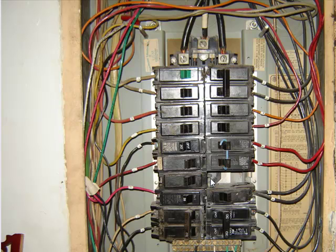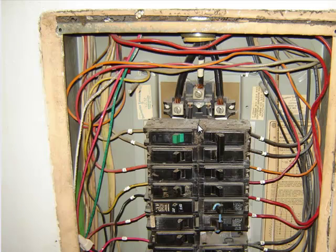It's burned-up lugs. I think I had done a video before of this — the burned-up bus bars in there. This breaker here, same thing — it's just all fried on the inside of it, so it was time for this panel to be replaced. Now these feeders are all going to get replaced as well, and they're going to go back into the new service. I'll be doing videos on that as I go.